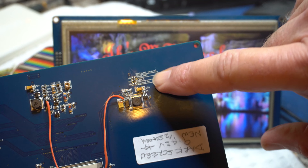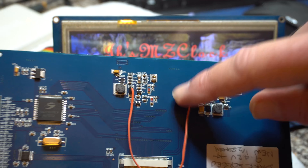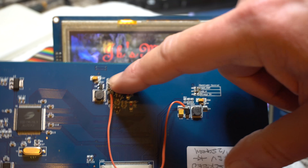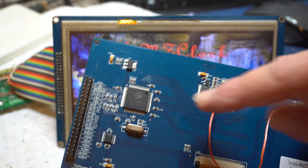There are subtle differences with this backlight controller — you can have it permanently on, have the SSD1963 chip control the backlight, or have the PWM controlled externally. This one seems dead so I've bridged it for now until I can ascertain how to get it going. Other than that, there are slight differences in the registers.